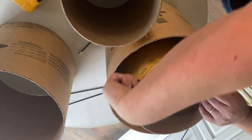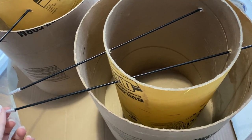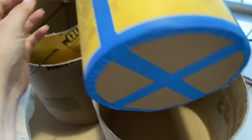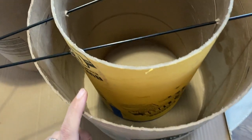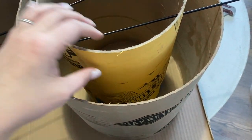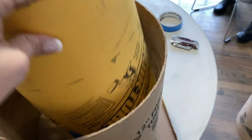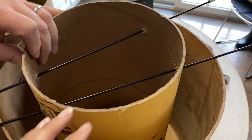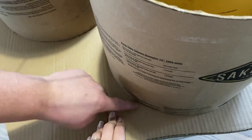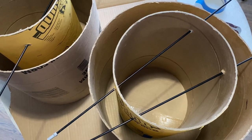Here's a quick recap of what my husband just explained. He threaded these little metal rod skewers through — you can use metal rods or wooden dowels, just make sure they're sturdy. He plans on filling it up about 2 inches, which is exactly the difference between the bottom and the top. He taped off a little base using painter's tape and cardboard to close off the open bottom. We're going to seal it with silicone caulk to make it watertight, and then we're ready to pour — this is the exciting part!